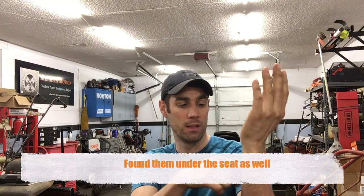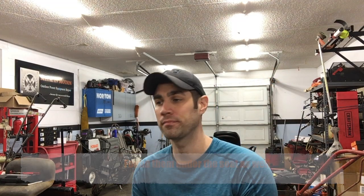So if I wanted any kind of deck spindles, blades, or anything like that, I have to reference the tag number on the deck — nothing else. If it's a zero-turn mower, I've seen the tag number under the foot platform, that flat part that folds up. There's a piece of frame in there that's got a tag number on it — usually a model or serial number. So that's for the frame components.